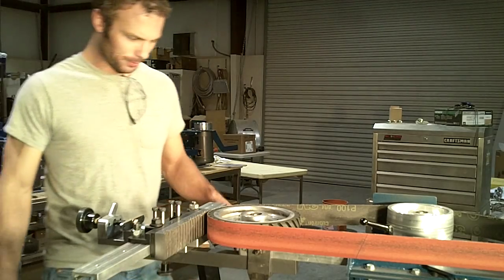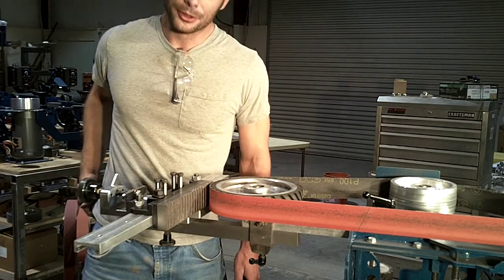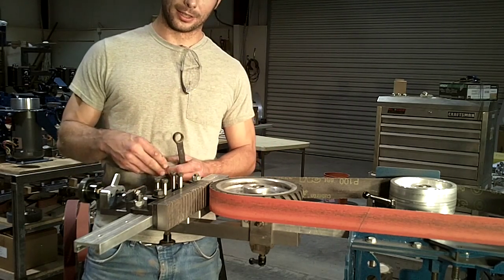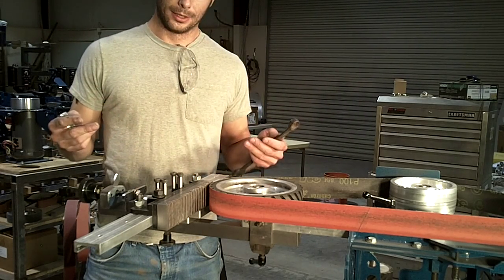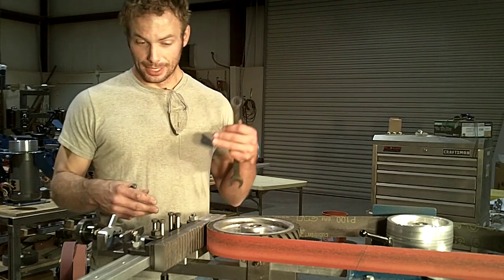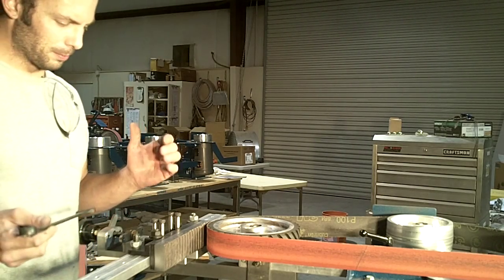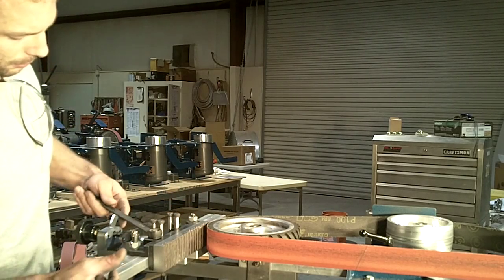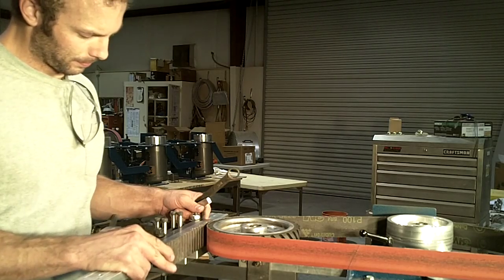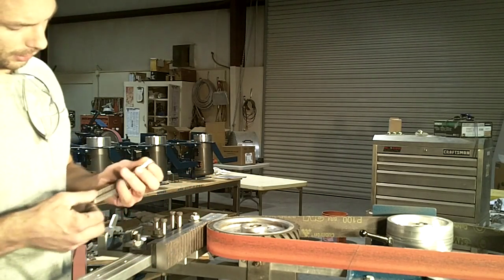What you may not notice is that this has a built-in tapering attachment and it works pretty slick. Those of you familiar with a surface grinder or machining know that if you're going to grind a taper, you need a sine block or a sine table and some means of setting an angle. You also need two shim stocks if you're going to taper a tang — one for the first taper on the first side, and one twice as thick for the second side. I figured that's a pain in the butt, so I simplified things. This has a built-in sine table with a doubling feature, and I'll go over this in detail in my other videos.